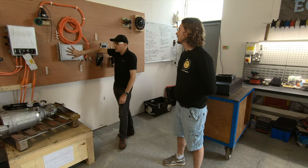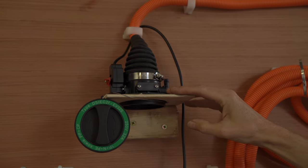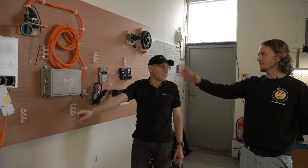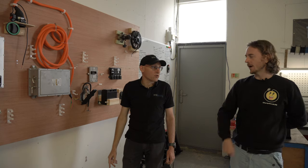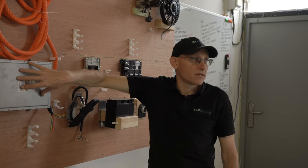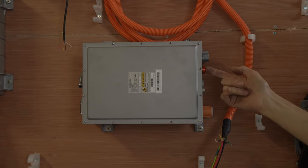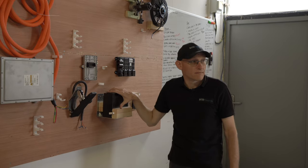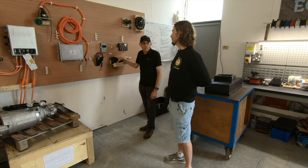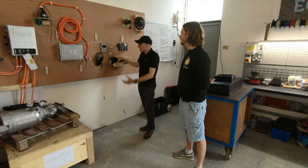This is the charger — a seven kilowatt charger. It takes 240 volt AC through the charge port and converts it into DC. Seven kilowatt is the maximum you can have from a single phase charger at home. This is water cooled, so it's quite compact — air cooled ones tend to be a little bit larger. It also has a built-in DC-DC converter, converting from 350 volt nominal down to 12 volts to power your 12 volt battery system, since there's no motor and alternator charging.